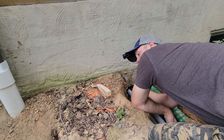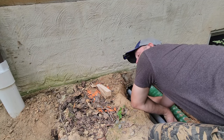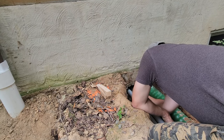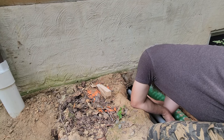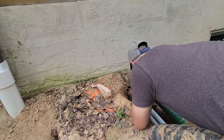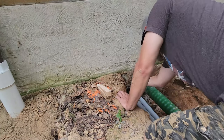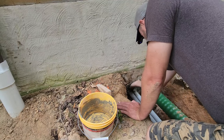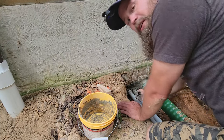And you want to make sure you get a good seal around the bottom. So I'm lifting this side up a little bit. Don't go crazy with it because you just mortared the stuff on the inside and it's still a little bit soft. But I'm putting about an inch underneath of the pipe, and then I'm just pushing, letting the pipe naturally fall into it. And that'll ensure that I have a good seal around it. Now we'll have to go mix up a little bit more because I want to bring this out flush just to ensure that this is sealed up.